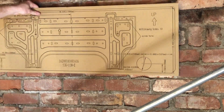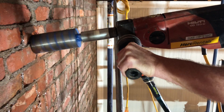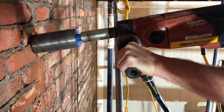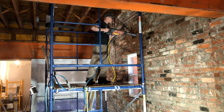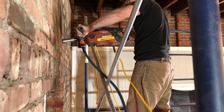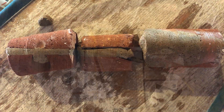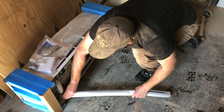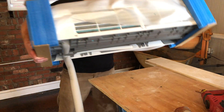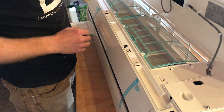Hanging the indoor units was basically the same as in the previous mini-split I installed. I used the included template to locate the mounting bracket for the indoor unit. The exterior walls of the building are 12 inches thick solid brick masonry. I bought a 3-inch diamond hole saw and rented a water-fed core drill to cut through to the outside. I decided to go with the Senvil Aura 18HF because it has a 20 SEER rating and because of my previous positive experience. I saved a lot of money and ended up with a higher performing system.